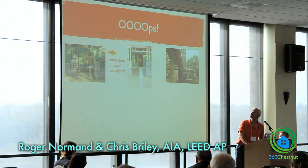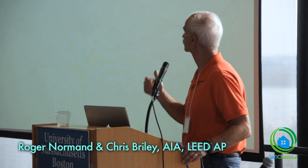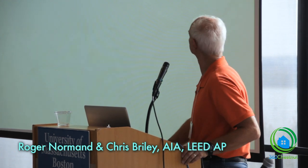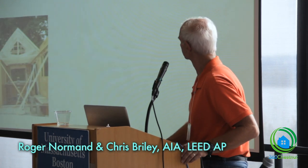Here is the windows over the south part, on the south facade overlooking our bedroom windows. This was supposed to be the abbreviated overhang, messed up. We ran the PHPP model again, and we had enough headroom there that we're just going to leave that as is. Cost us about 0.5 in AHD. But we're still within the heat demand limit.